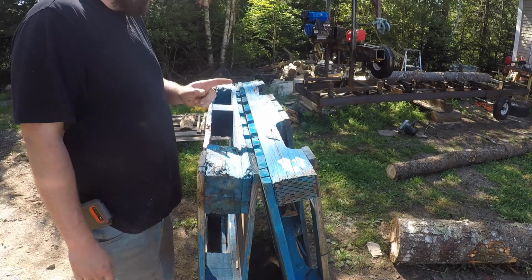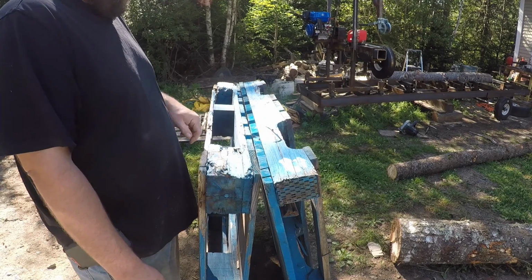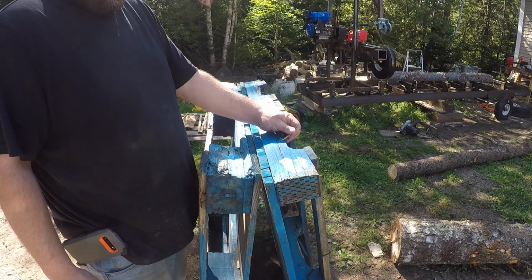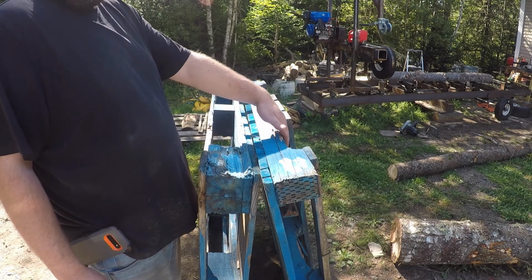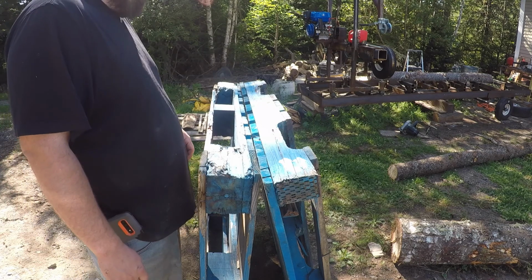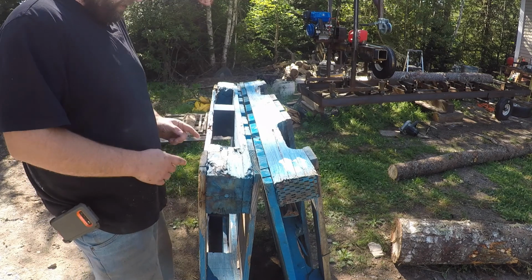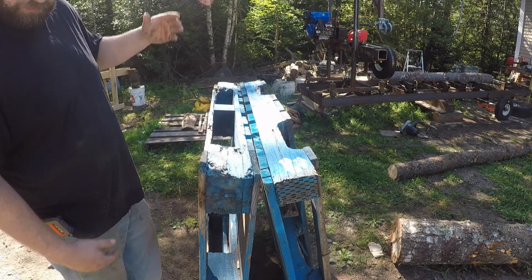Unfortunately, these two pallets are built differently. This one has runners, this one has blocks. When I made up this plan, the logs are going to sit up in the fork pockets on these runners. That is still the plan, but this one won't sit right, so we're going to cut the boards out of the bottom and put some spacers in so they'll sit at the same height.